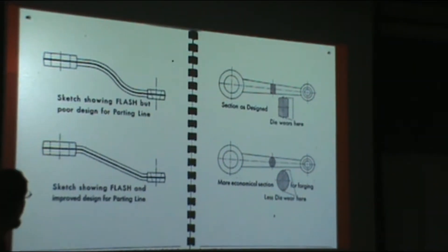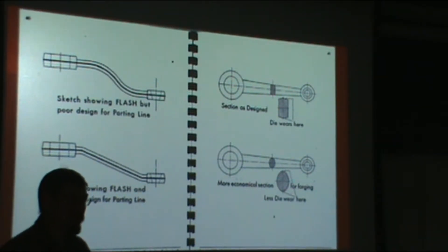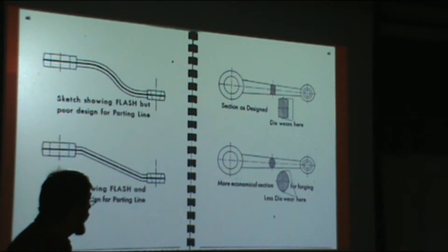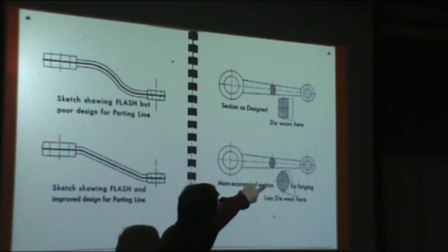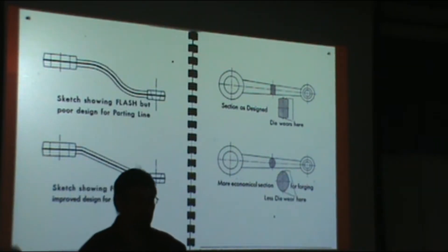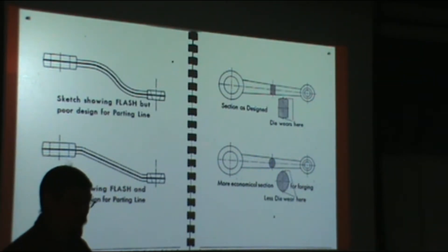These are always designed with a certain amount of draft or relief, and a lot of times the surface may not even need to be machined afterwards — maybe the critical dimensions are just certain holes and the rest is within generous tolerances. Here they're showing where the parting line or flash line would be, and how they've changed the design a little bit to make it easier to manufacture. As engineers and designers, it's sometimes necessary to tweak the design of a component to make it easier or cheaper to make. Some of these design differences also help the tooling last longer.